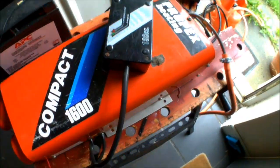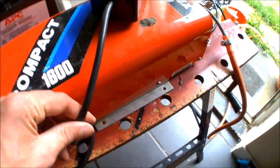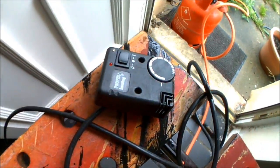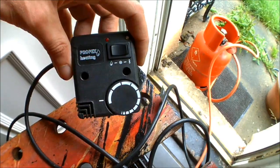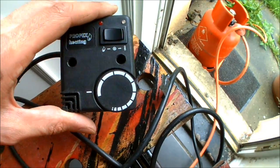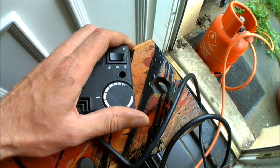The units themselves generally have the igniter box — they're generally hardwired, you don't need to play about with those. The other wire that's coming off feeds around to the thermostat, which is what you'll generally wall mount within your van, caravan, or wherever you're going to be putting it. That's the unit that controls both the heating element and the fan element, with your temperature selection.